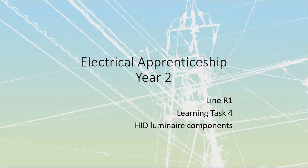So what we're going to see is a lot more of our higher voltage ballasts these days rather than the low ones. The purpose of the ballast is going to be twofold. Every single time that we have one of these, it is going to be to give us our striking voltage, whether that's a higher amount of voltage or a lower amount of voltage. And then it is also going to maintain the current.